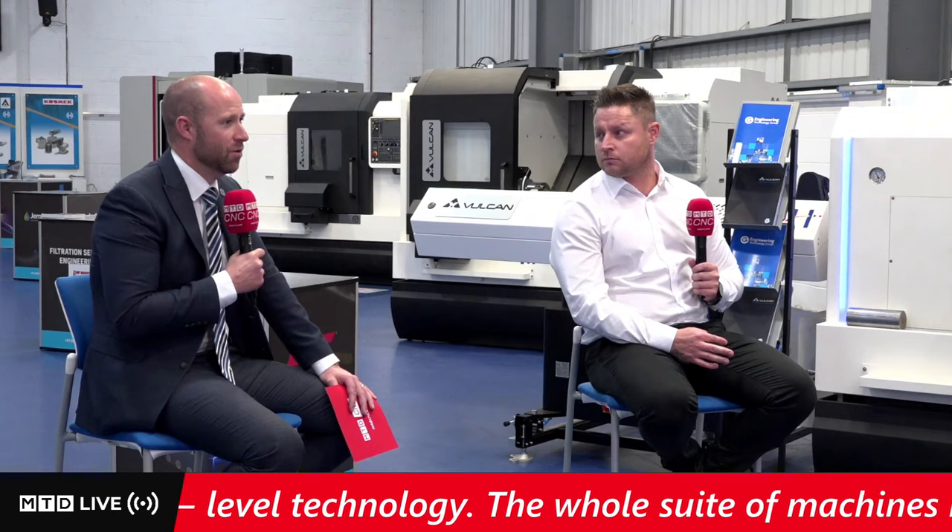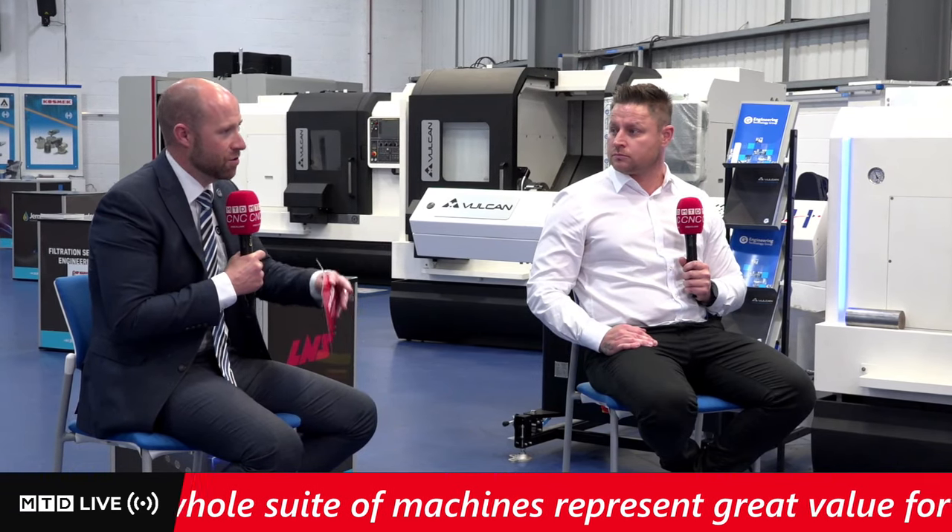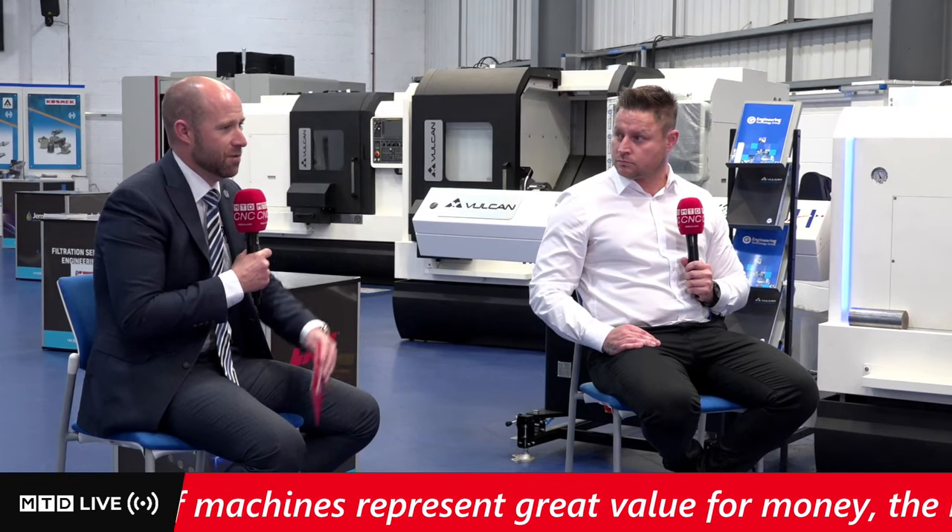What material are we cutting here? This specification isn't a problem, but this strategy is probably better for tougher materials — your titaniums and similar. That's where it was designed and developed, so you can increase tool life on that type of cut. With the TC range, customers always want to look at cost per part, so being able to take a software package like Hypermill with its turning environment on a commodity machine gives customers excellent value for money.